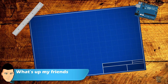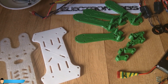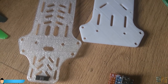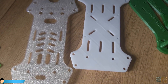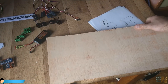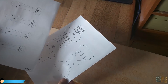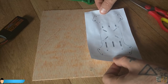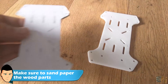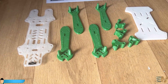What's up my friends, welcome back. Let's take a look at all the parts that we need to build the entire drone. First we will need a body. I've 3D printed mine using PLA material. You have all the STL files ready to download in the description down below. If you don't own a 3D printer you could always cut the body from balsa wood. I've left the link for this layout in the description as well. Just print it on a piece of paper and glue the paper on the balsa wood, then using a fine saw cut each part. Finally drill the holes and you are done. Now that we have the parts for the body let's take a look at the other parts.